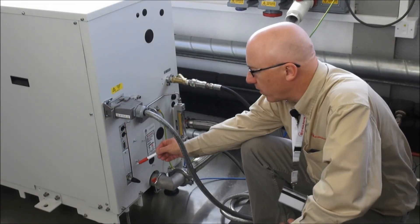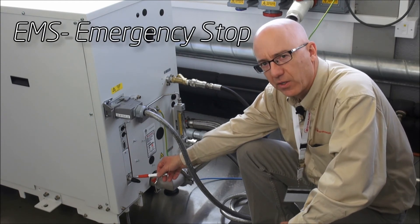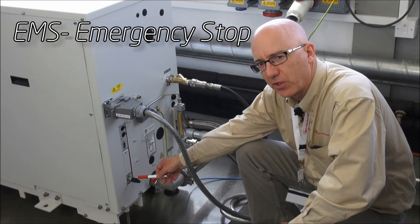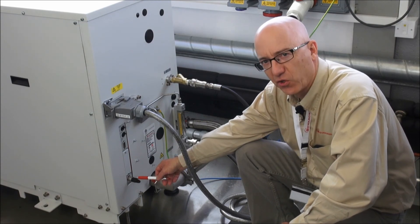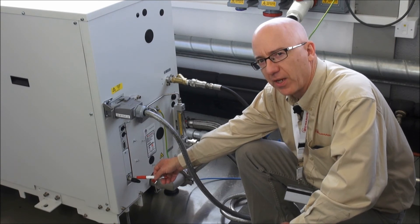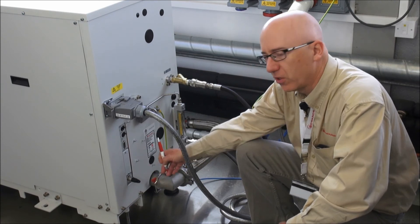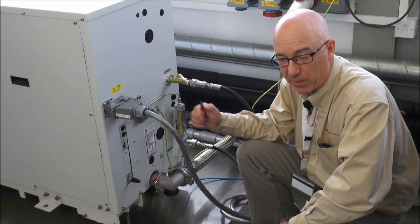The contacts within the EMS plug itself enable two things. First of all, they can be wired into the customer's own emergency stop system to force the GXS to stop under appropriate circumstances. But also, there are contacts here to signal out to the customer system that the emergency stop button on the front of the GXS has been pushed.